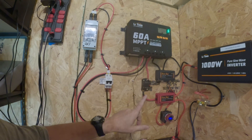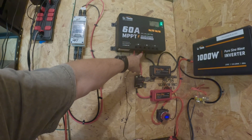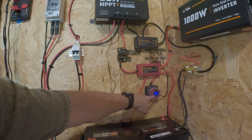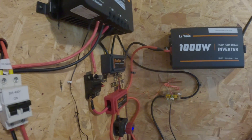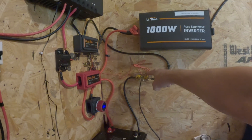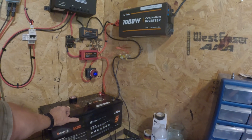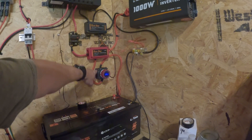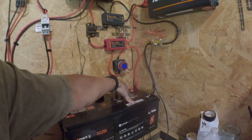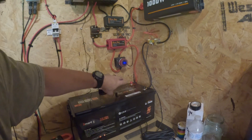The low temperature sensor wire is also here. The 10 gauge wiring runs from a disconnect all the way up into the charge controller. The red wire feeds a 70 amp disconnect into my bus bar, which feeds another disconnect for the battery and also feeds my pure sine wave inverter. A small red wire feeds my shunt. I haven't configured the battery monitor yet — it's showing 100% and you need to drain it down first, so I'll do that later.